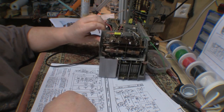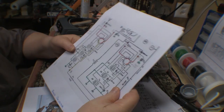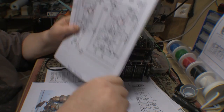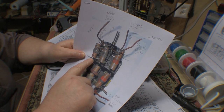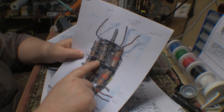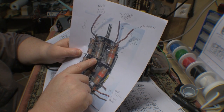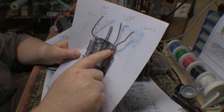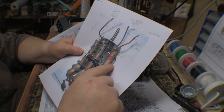The little breakthrough I had here: on the local oscillator you have the three transformers and one end is tagged to ground. Looking at it physically I thought, well since the three of these are mounted here and this is a ground plane, that's the three grounds. But in fact it's not, because for instance this one here has no coil connected to it — this is purely a physical way of mounting the coil. So in fact the only way you have three coils connected to ground is with this one across here. I'm 99% certain this went to chassis, but it seems strange it would do it that way when there are plenty of chassis connections right along here.